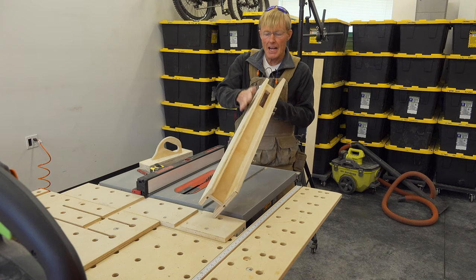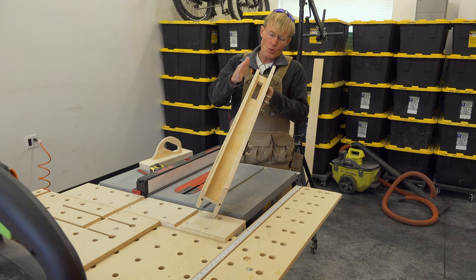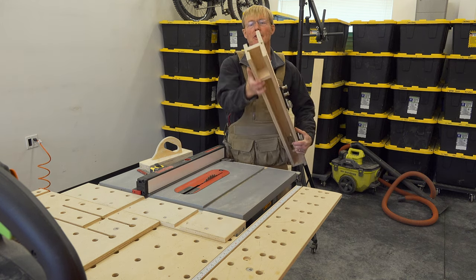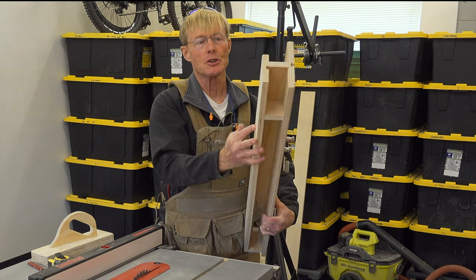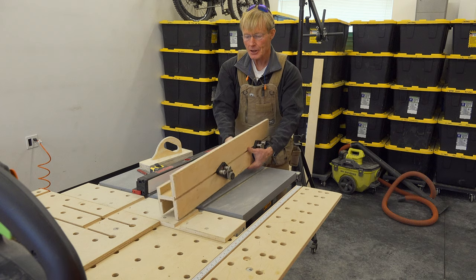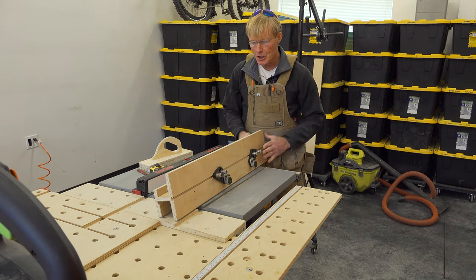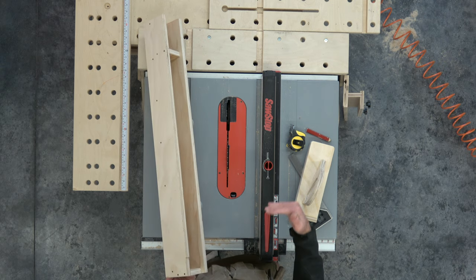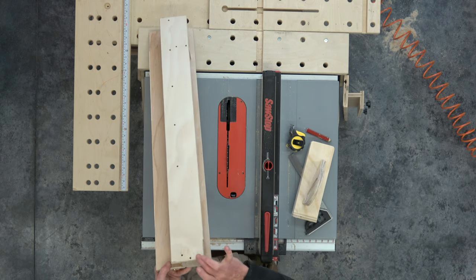By leaving this back side up a bit, I think it helps with the stiffening. I've got a deeper dado about halfway through the material, and that's glued and screwed — then glued and screwed to the other side as well, which creates a really nice I-beam. It should keep it fairly flat. The blocks front and back act as stops and also help keep it squared up.